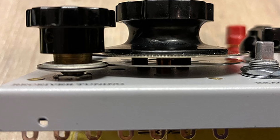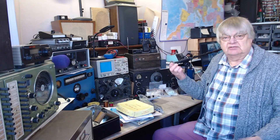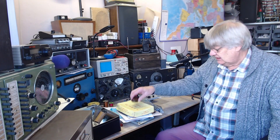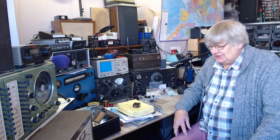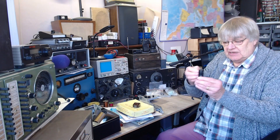That wasn't easy — I had to put spacers in there, and of course as the tuning dial is now higher than it probably should be, that knob there won't go on the shaft. It's all bits and pieces like that — the wrong crystal and stuff. So I can't go on 80 metres; I can go on 3.2 MHz if anyone wants a CW contact.